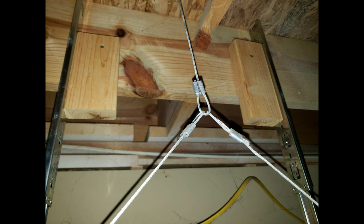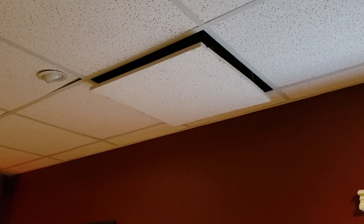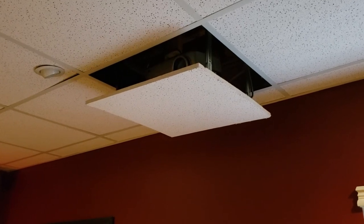I did the same thing from the right side of the lift, making a cable attached to the L-channel reach the same central location above the lift. I then extended the actuator fully and determined where I needed the projector to sit fully extended. I marked the cable coming from the pulley, cut it, formed a loop with a ferrule and crimped it. I attached the two side cables using a loop and ferrule method to the pulley cable. I now had a fully attached and functional lift system, and I tested it several times — it functioned great.